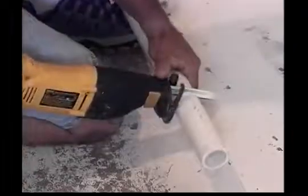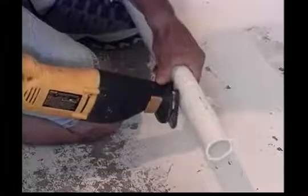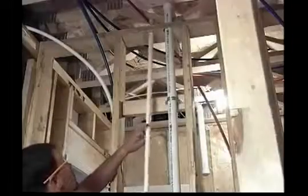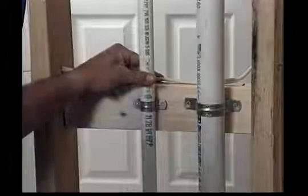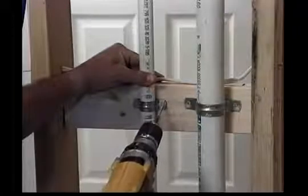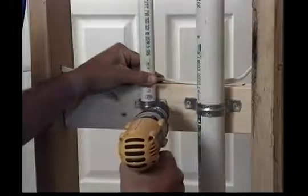If a vertical lift is required, it should come before any horizontal run to allow for efficient pumping. An uphill pipe run must not be used because solid materials will settle in the lowest part of the pipe run and eventually this accumulation may block the pipe. The macerating pump unit must have at least three feet of discharge pipe before transitioning to a larger pipe size, which allows the macerator to operate for an adequate time to ensure efficient waste reduction.